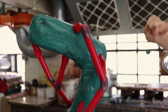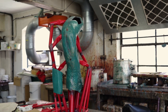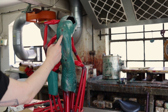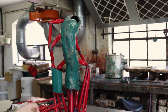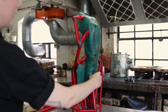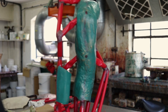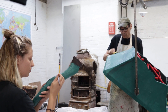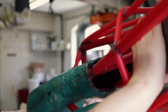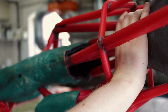You can also see it's about two or three millimeters of green wax. Then we back it with a brown wax, aiming for a specific thickness that we want the bronze to eventually be. That brown line that goes down the edge is where it's seeped in for the seam lines. These black dots are where we're planning for the runners and risers. So you can see that it's hollow inside — we've aimed for at least five millimeters thick of wax, and that's what we want the bronze to eventually be.